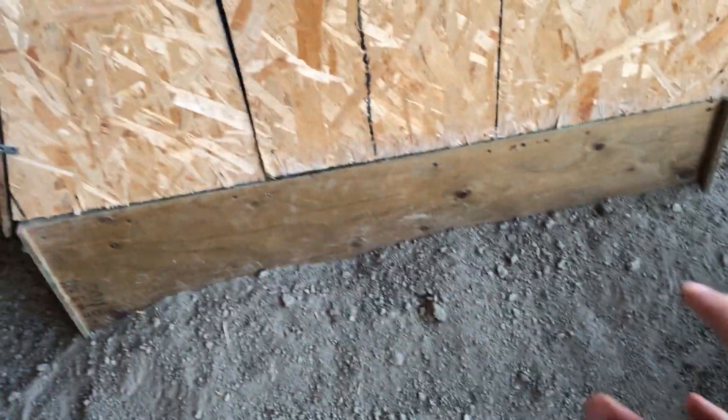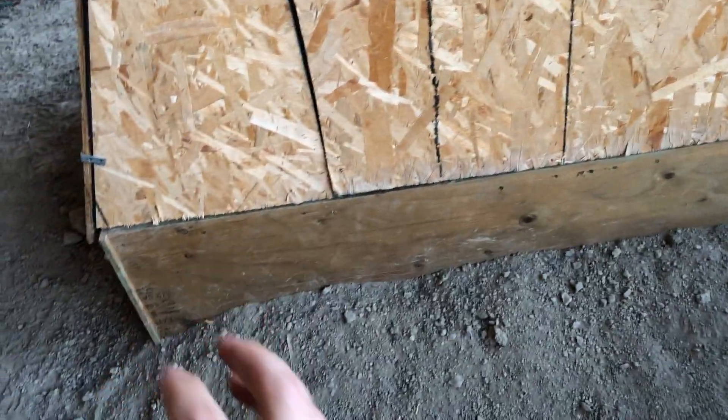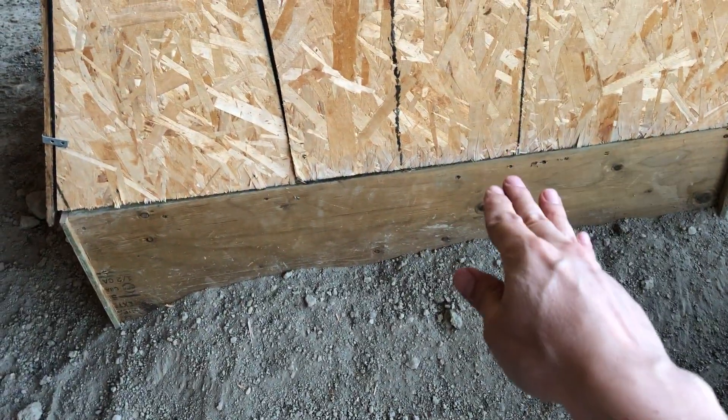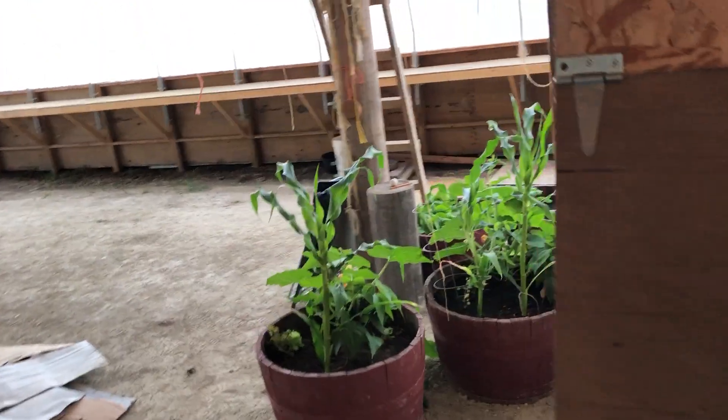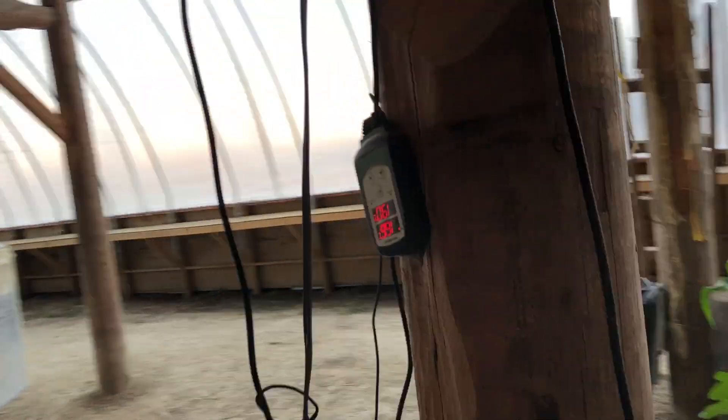I took a hole saw and put in holes all along it — it's about four and a half feet below grade. You can't see any of those right now because it's all been backfilled. I've got a couple of temperature monitors hooked up to measure the temperature below this manifold, and I can also measure the temperature at the intakes at the peak, so I can look at the delta and see how much energy is actually being transferred into the ground.